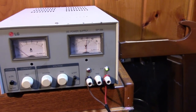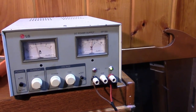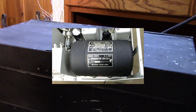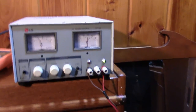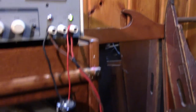Keep your eye on the power supply. See how the power supply didn't like having a dynamotor, and it temporarily went into crowbar — but this supply actually tolerated it and reset itself. Also listen to the dynamotor — how quiet it is. That's the way a dynamotor should sound in a BC-348. Now we can alleviate some of the problems of that turn-on, since a lot of power supplies are not going to be as forgiving. So we're going to put a 15,000 µF 50-volt capacitor across the output terminals, and put a clamp-on choke close to the receiver power inlet so the dynamotor noise doesn't get radiated down the cord.